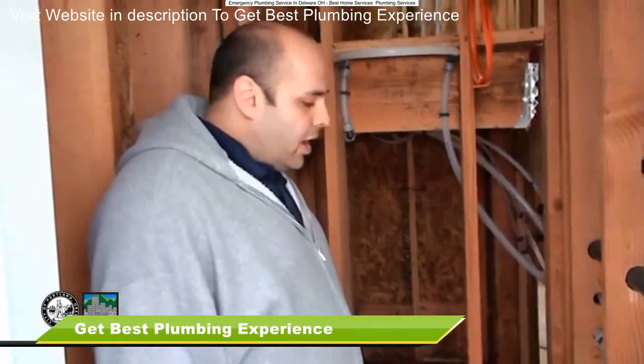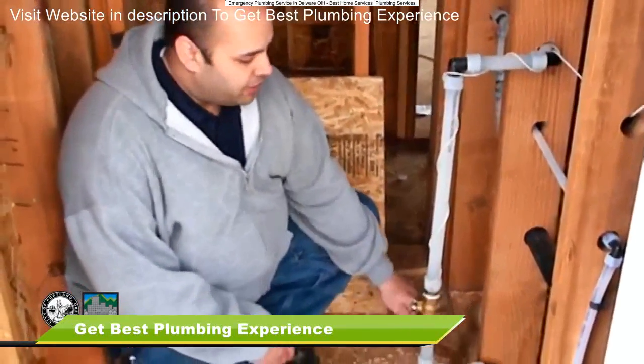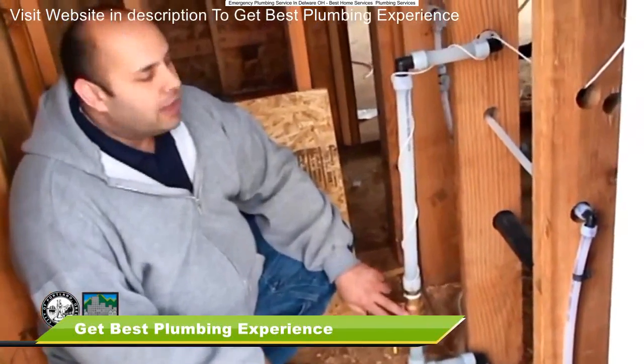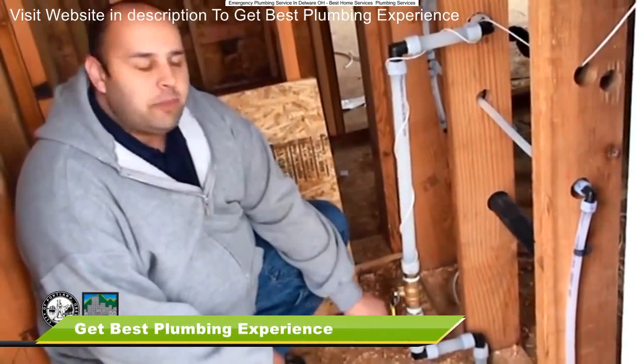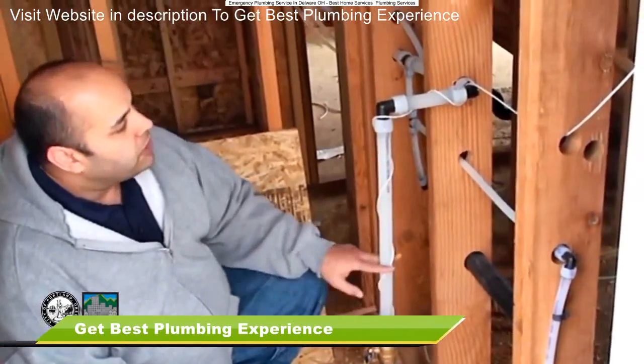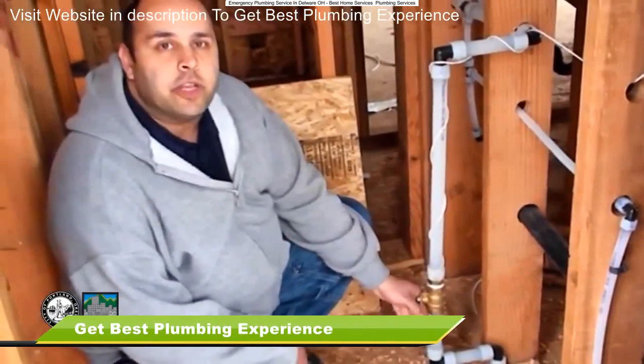We're here in the utility closet, and what we have is our house main shutoff valve that comes into the residence here. This is a full port ball valve, and that allows the water to come in from the street main, from the meter outside, into the residence. This controls the water, so if we have a problem we can shut it off right here without having to run out to the street.